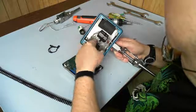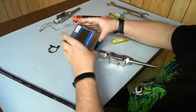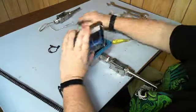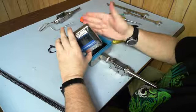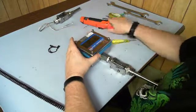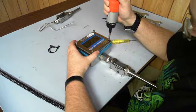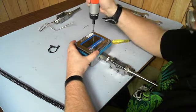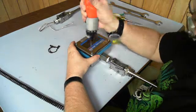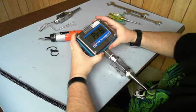Tighten down. That should look something like this — and that's the installation of the probe. Take the screwdriver, place the battery into the unit, and make sure you did it right. Take a torque wrench or screwdriver and torque the screws down four to five inch-pounds at the complete assembly.